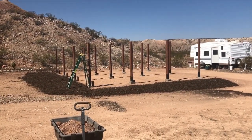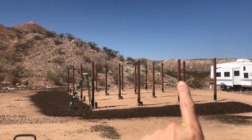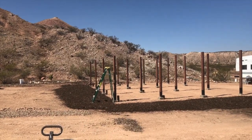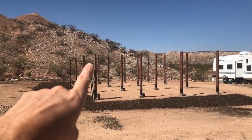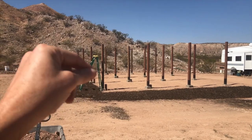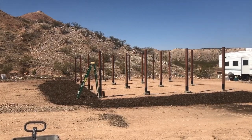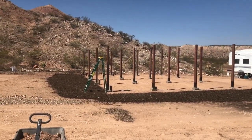All the posts are cut down now. These are about eight feet tall, and then they drop about four inches, four more inches, four more inches — so these back ones are about seven feet tall. That'll be both sides; I'd like to be able to drive through either way. So the lowest side will be seven feet, which should be plenty of height for the truck. I just need to do a quick housekeeping on top of each of these posts since I cut them all off and they're all treated — I'm going to use some treatment to paint on the tops of those. Then we'll get started on putting the beams on top. We're going to prep the beams by shou sugi ban — burning, brushing, and sealing.